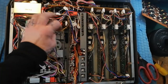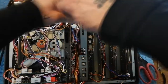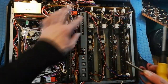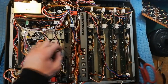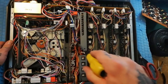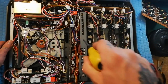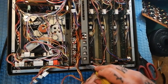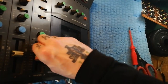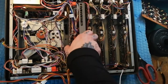You're going to have one long brass post here with a plastic sleeve on it, and then there's usually another one about here. It's not present in this one because the post on the front plastic face into which it screws is broken, so it's already been removed. The third screw is right at the bottom of the record board here. If you've still got your master fader knob on, that's going to need to come off. The other knobs can remain on. At that point you should be able to lift it out — that's not to say it's going to be easy.